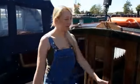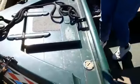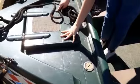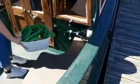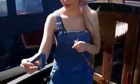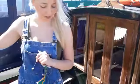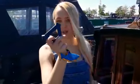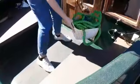Starting at the front of the boat, this section houses the water tank. We fill it using this hose — it's better to use this rather than opening the cap directly, as leaves or debris can get in. Under here there's a basket, and we provide a hose pipe. The key has a long flat edge that goes in and untwists to open one end of the hose pipe; the other end connects to any of the taps along the canal, which we'll point out when you arrive. To tighten up again, screw it back and everything stores neatly here.